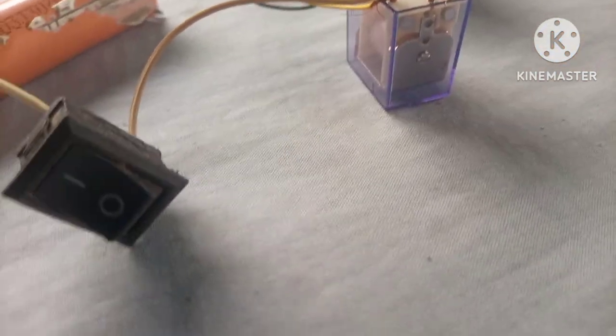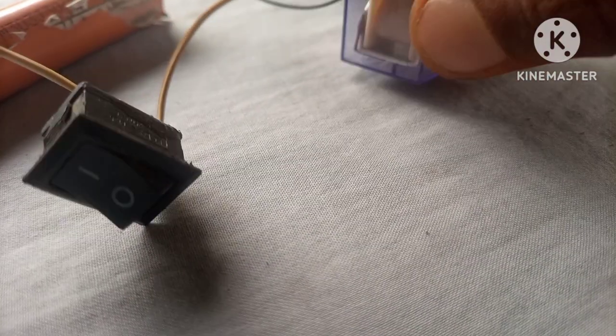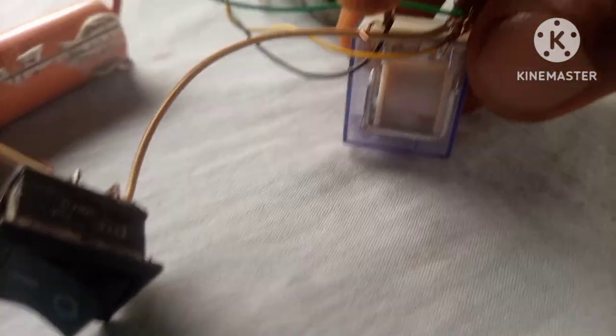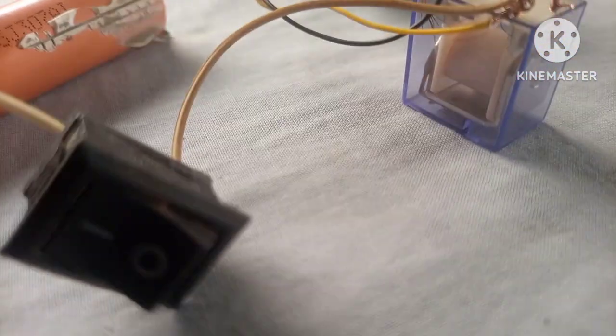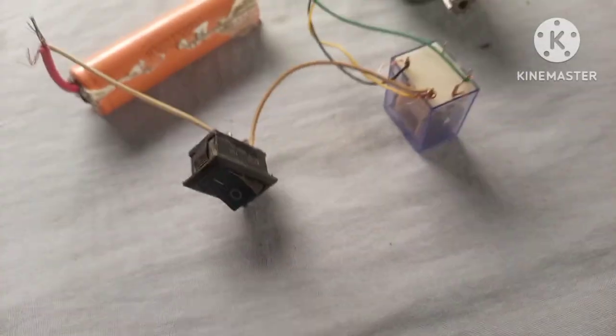The reason why the circuit is not outputting any voltage is because the battery is too low to energize the coil anymore, so it can't attract the COM to contact the normally open. Comment down below: is this DIY build better than a BMS?